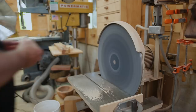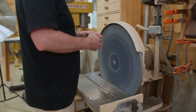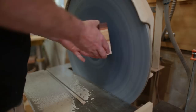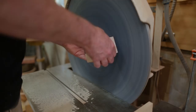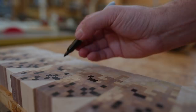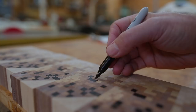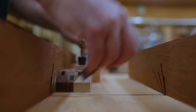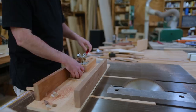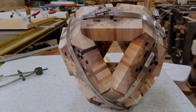Now I sanded these a little — mostly the edges, but I can't really sand the edges because I don't want to round them over. So I'm lightly touching the faces to the sandpaper to get the edges flat. I needed to keep track of the pattern in the ball with the pattern I was putting together — it was straightforward, but something that could be screwed up as far as keeping the direction of each piece right. Now I can cut the pattern pieces. I have the saw blade tilted at 45 degrees, and you can see how the square pieces and the pattern pieces will go together and make a ring.